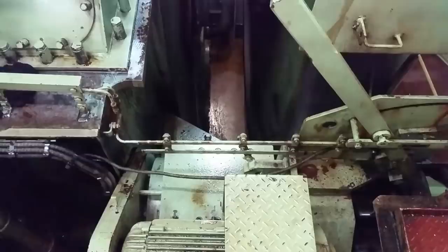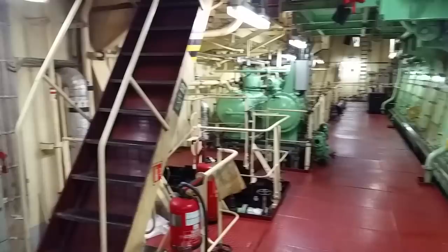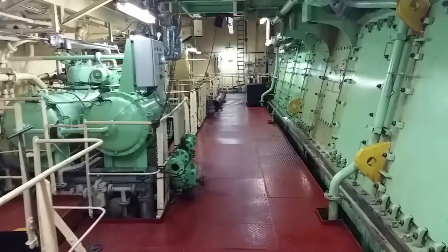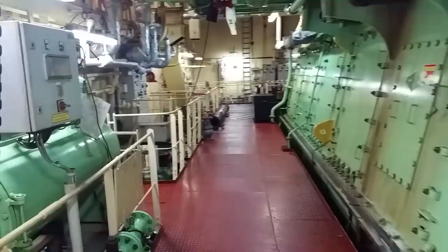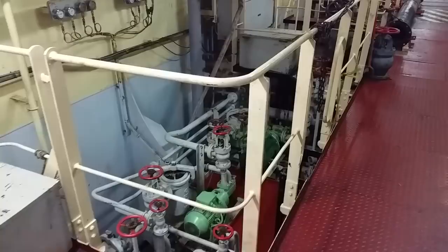Under the stair ladder there are a couple of little pumps. Here's a weather bilge pump, and here's a sludge pump — that's how we pump our sludge overboard once a trip to a barge. The green unit to the left is the oily water separator, also known as the OWS — it does exactly what the name says: separates the oil from the water. These are little lube oil pumps and a lube oil transfer pump, with strainers on the suction side.